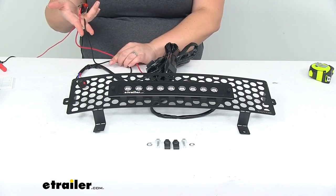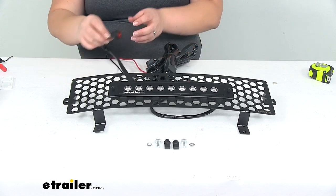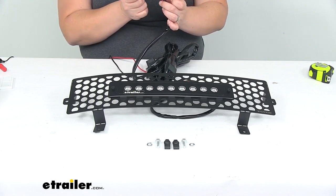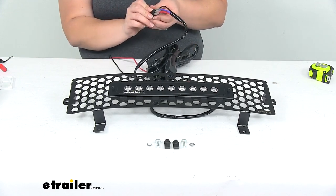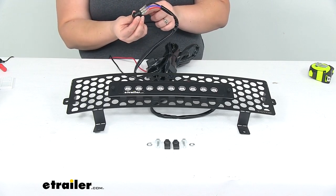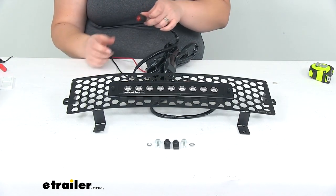As far as the connections, it's just power and ground — red goes to power, black goes to ground. The switch has three little prongs to hook up to, with a tiny number next to each one. The first is red, second is blue, third is black. Once you can see those little numbers when you get the switch, you should be able to get those hooked up to turn it on and off.